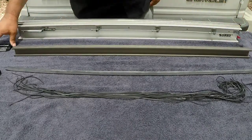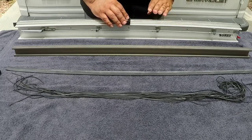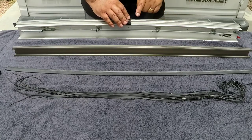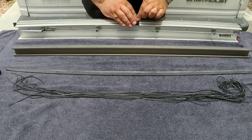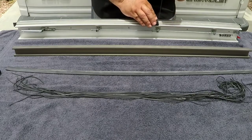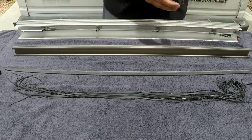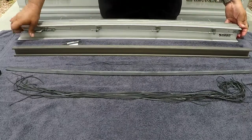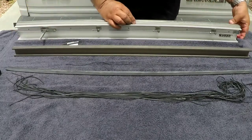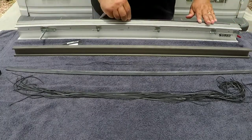You're ready to cut the rubber. Grab your trimmer. Put your finger right on top of the razor blade right in front of the rubber. As soon as it starts cutting, grab a hold of that rubber, start pulling up, and go across at a steady pace. There it is — I just cut it. Open it up. Grab this one, and slide this one and the other one across again, flush with the stop.